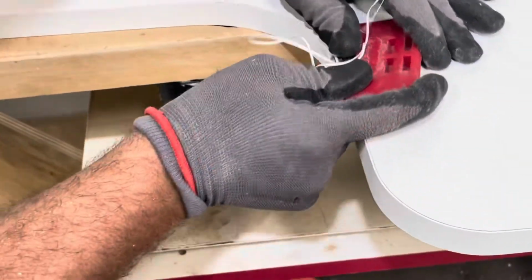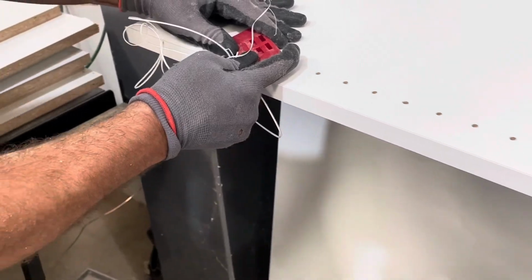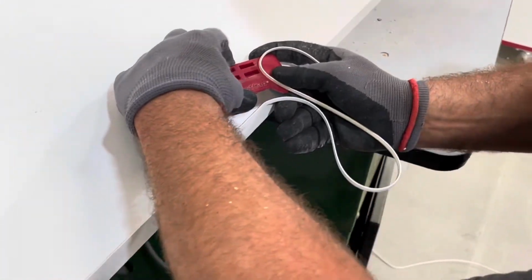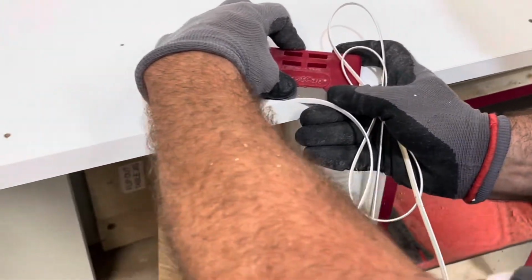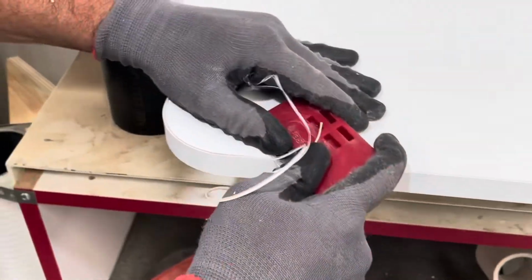Here's the product in my shop. I've got a guy here trimming a radius hutch that we do contour edge banding on. He's put that on with the contour bander. He just sets it on there and kind of keeps it at a negative angle. That way, if by chance it catches on the material, it doesn't dig in and he won't damage the part, and it just goes through there nice and smooth like that.